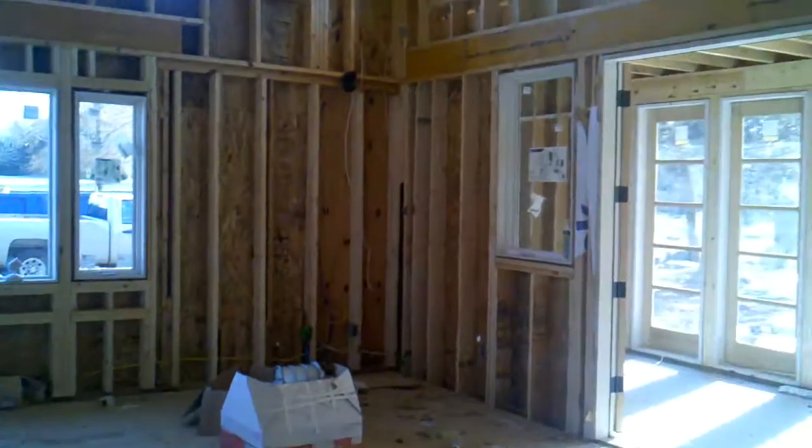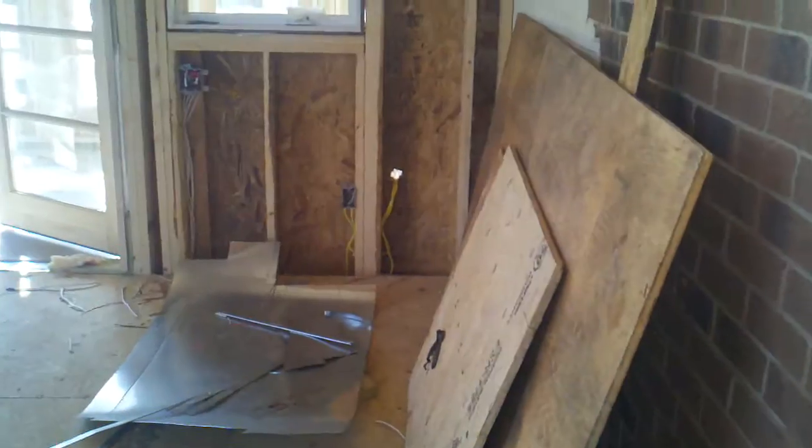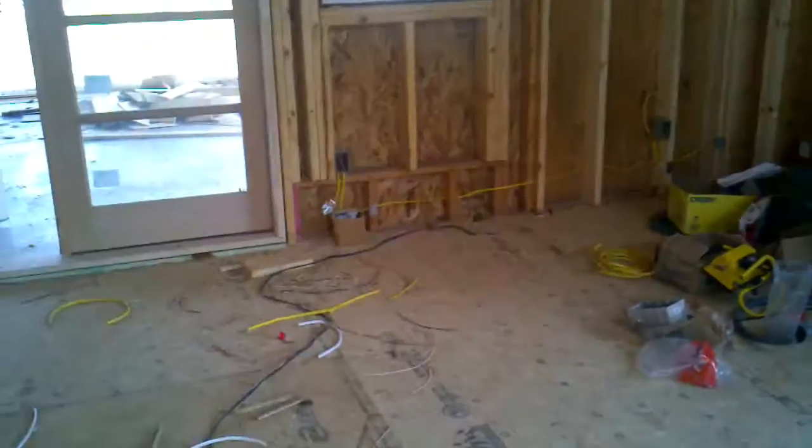In here, let's deliver it again. We've pulled number 12 to the outlets because there's no crawl space here. The wiring goes through there and through there, and the home run is actually over here. It comes up right here, and we've stuck it through the wall right there. It's right beside that dining room outlet, to the right of it.